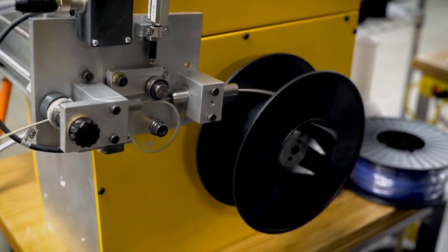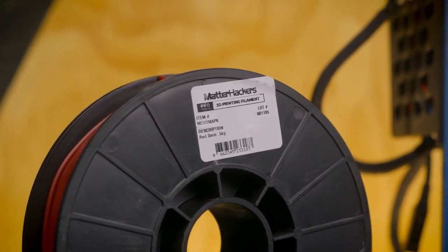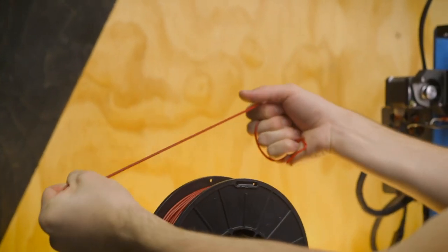Each of these materials has different properties like shore hardness or elasticity, depending on the formulation of the spool of 3D printing filament. With a flexible filament like MatterHackers Pro Series Flex, you can drop it a thousand times over and it won't ever break. But that doesn't mean it's ready to replace other materials like PLA — every material has its place. Flexible filaments are great for gaskets and bumpers, but you wouldn't print a shelf bracket with them, and conversely, you wouldn't want to print a PLA shoe sole.